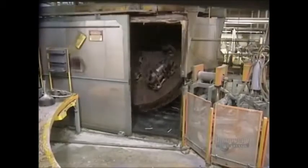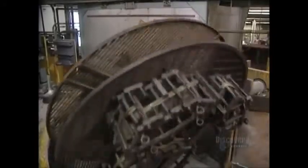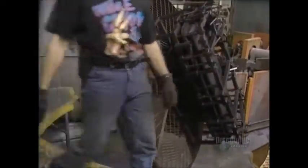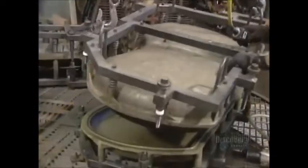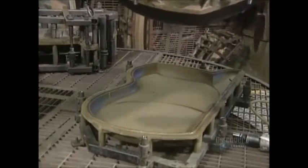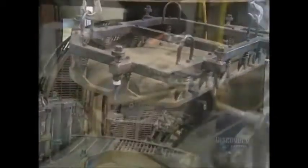The mold is placed in an oven which generates a temperature of 310 degrees centigrade. About 15 minutes is needed for the polyethylene powder to melt, and another 15 minutes to allow the piece to adequately cool before unmolding it. The mold cover is lifted off and the plastic piece is unmolded. Gloves must be worn since the piece and the mold are still very hot.